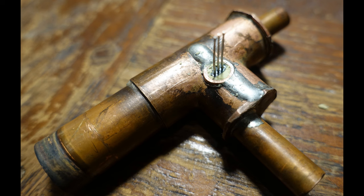I am no soldering expert but I have made and remade a number of pieces of copper distillation equipment, and here I share a few techniques I have found useful. Soldering copper is easy. It is easy to clean with abrasives such as emery paper or wire wool. The solder readily fills narrow spaces by capillary action. The process is fairly forgiving for both poor cleaning and uneven flux application because, like the solder, the flux is drawn by capillary action into joints.